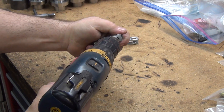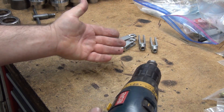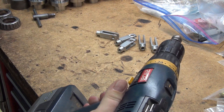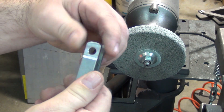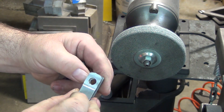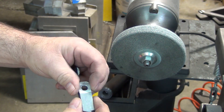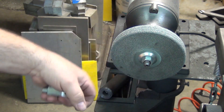All these steps add up, but it's still cheaper and easier to modify an existing product than to make those myself. Depending on how hard I push the cutter across there, sometimes it leaves a pretty good burr — either way it leaves a bit of a burr. The scotch-brite wheel takes it off without me having to worry about big sanding scratches or taking too much material off.